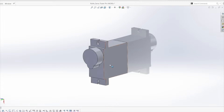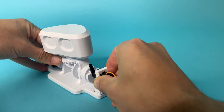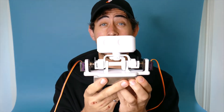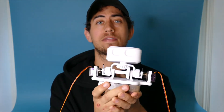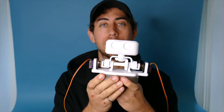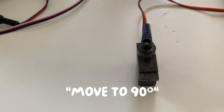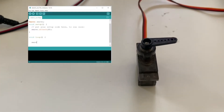I then made these servo adapters and added some tabs to the base. The servo adapters just pop into the base with the servos in it just like this. If you want to make your own Rob Bob sculpture, either in mechanical form or servo form, the files are available for free on my website — the link is in the description below, and it also includes the code and wiring info for the servo version. Servos are great because all you need to do is send them an angle from the Arduino and they'll move to that position, which only takes one single line of code.